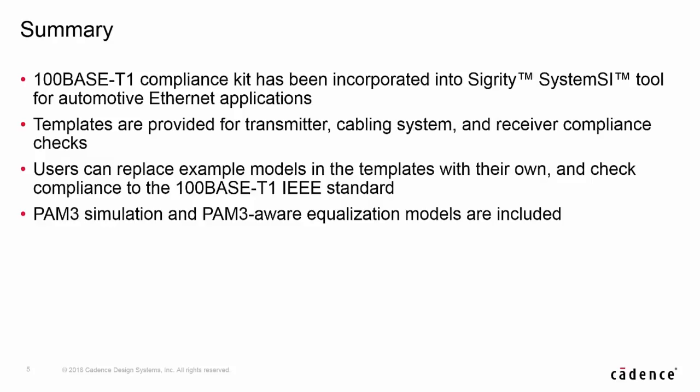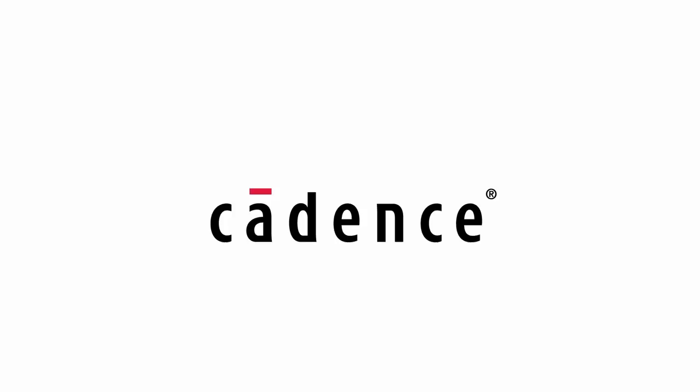So, in summary, the 100BASE-T1 compliance kit has been incorporated into System SI for automotive Ethernet applications. Templates are provided for transmitter, cabling system, and receiver compliance checks. Users can replace those example models in the templates with their own and check compliance to the 100BASE-T1 IEEE standard. PAM3 simulation and PAM3 aware equalization models are included. That concludes the demonstration. Thanks for watching.